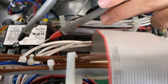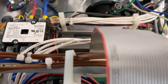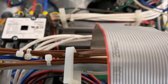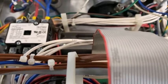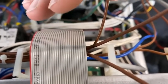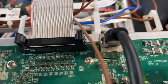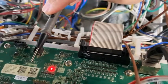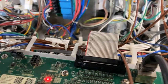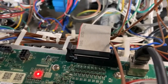If you do have power coming through this contactor, your next step would be to verify the middle connector on the SSRB, which is the incoming power supply. If you take that off, make sure you have all your connections on it. If the power is there, the next step of the circuit comes to this ribbon cable. The power goes through the SSRB via the three small transformers, and then is brought up to the SSRB. There is nowhere to test on the SSRB for the high limit circuit. It does represent a small light here, which shows you high voltage. If that's out, then it isn't seeing the voltage. The easiest way to test the board is to remove it and swap it with another lane; otherwise, there is no way of confirming if there is an issue with that board or not.